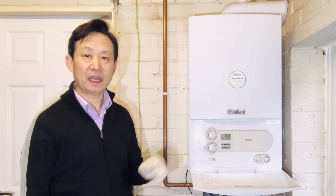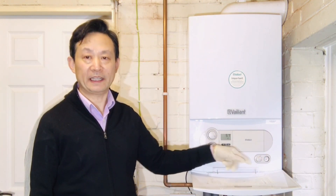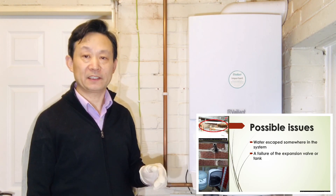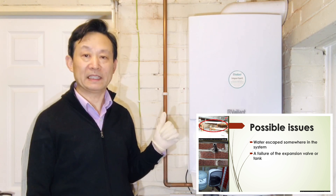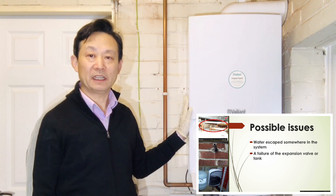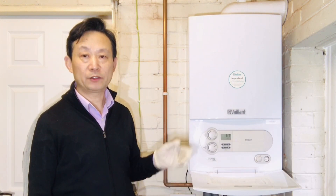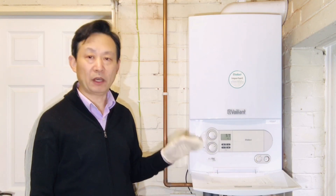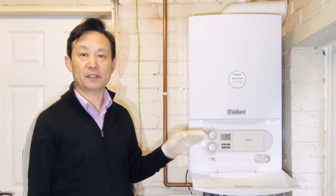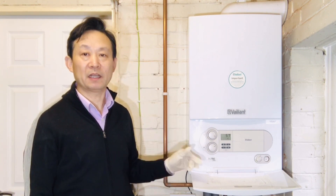However, sometime after you top up the water, a few hours later this meter will drop down again. That means you may have a consistent leak that you need to repair first. Or you may have a sensor problem inside the boiler. Or you may have a leak inside the expansion tank. Today I will show you how I do the diagnosis to find where the problem is, and how I can temporarily repair these problems so I have hot water until I find a proper gas engineer to repair my boiler.